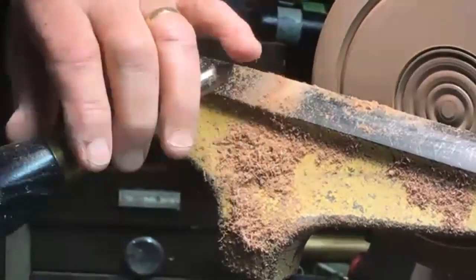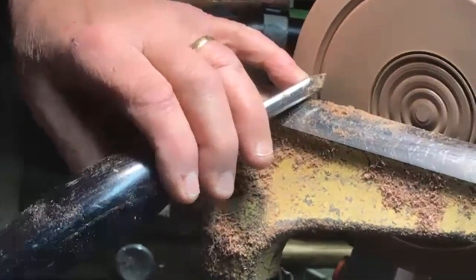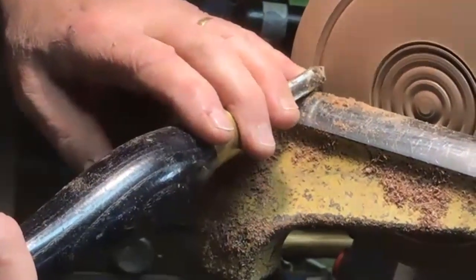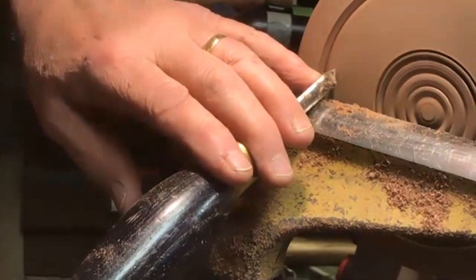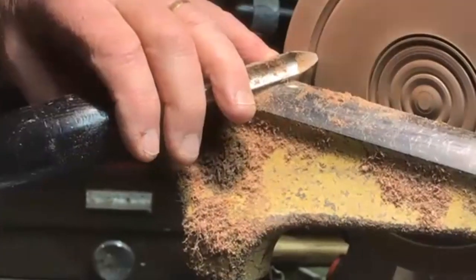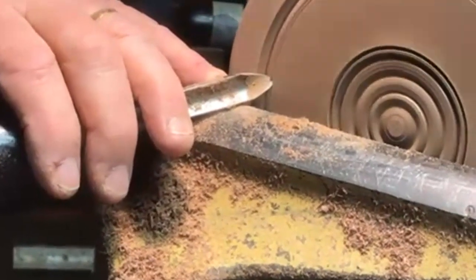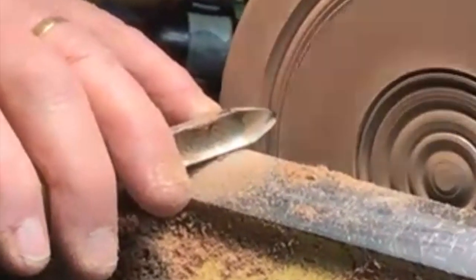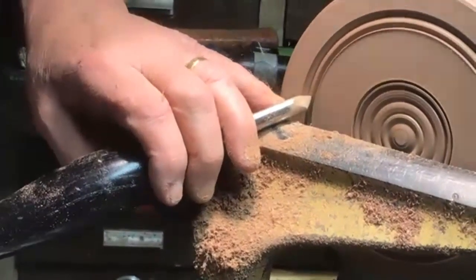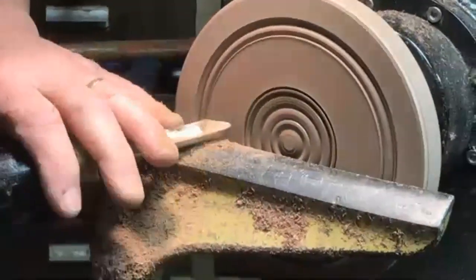Going from cross grain to long grain changes things. I could go this way or cut in again just like before. I'll put the half bead in here. Now let's turn this bead - notice the flute is at three o'clock and the handle is quite high. I want to bring that down a little smaller. To take the cove out, my tool rest is too high to make a cup, but I can put the flute at about 2:30 and push.